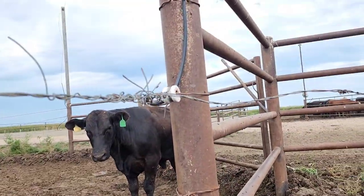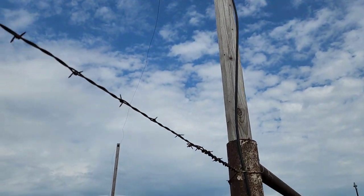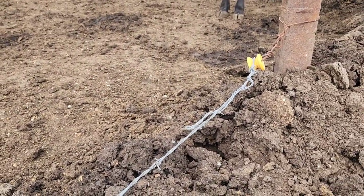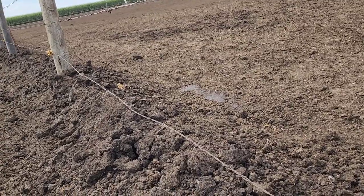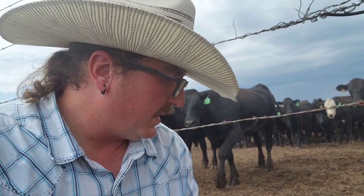And you see this right here? That's that jumper I'm telling you about. Jumps it across. And then it also goes up and over and then down, and that's how that side of the fence is powered. But I'm gonna go ahead and take this off over here at the end by the post. I'll undo the fence, pull it off the insulator, put stretchers on it, stretch it back out, wrap it back through the insulator and tighten it back up. Maybe. We'll see how that all works.